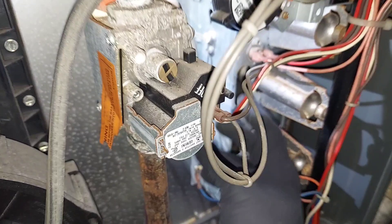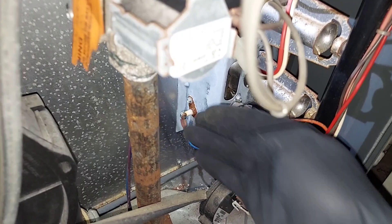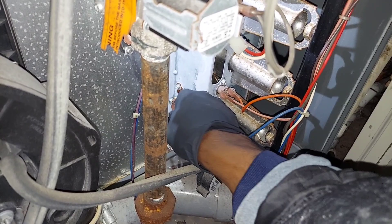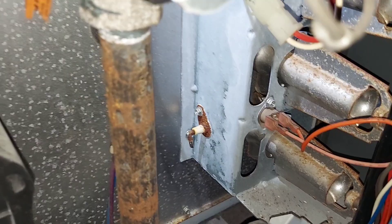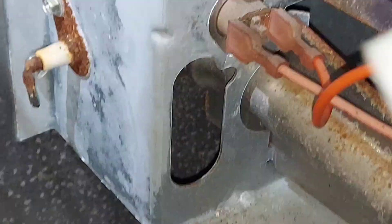You're going to unplug this harness right here, and then unplug this little white wire connector — just pull it right off. Note that this connector is orientation sensitive, so you must check your orientation when reconnecting it, because it won't go in if the orientation is incorrect.